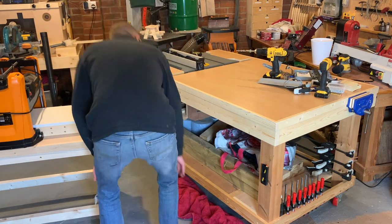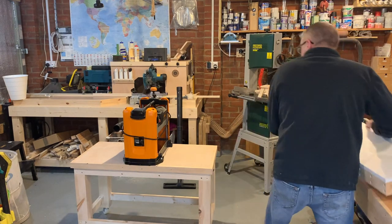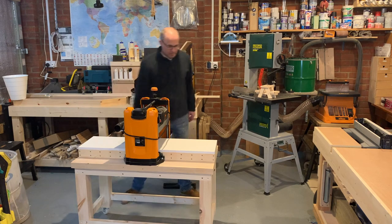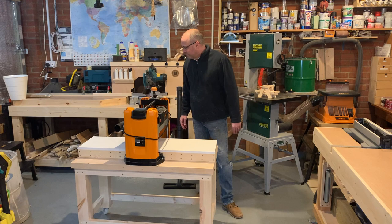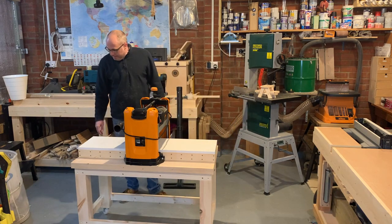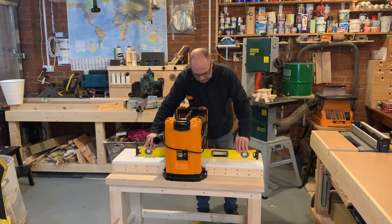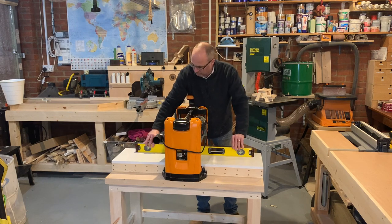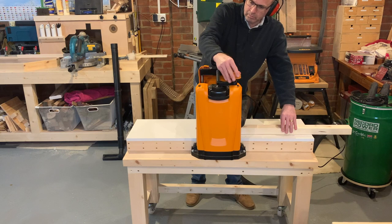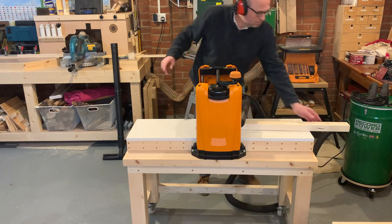The plank's in place so it doesn't move, and there's a 25mm pocket hole screw. I'm not sure if you can spot the problem here - I've done my pocket holes the wrong way, so the screws would have to go upwards, which clearly isn't going to work. I need to re-drill that one. One side done - that seems to work. Now let's see if it fits. It may help if I put the dust extraction on - what a difference that makes.